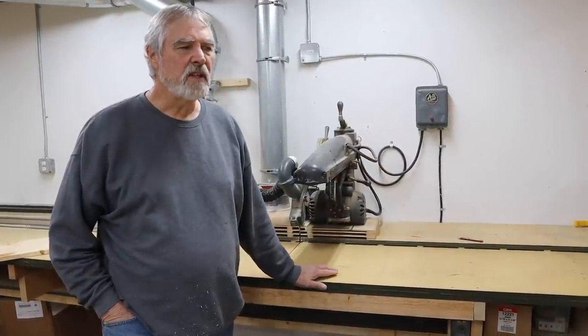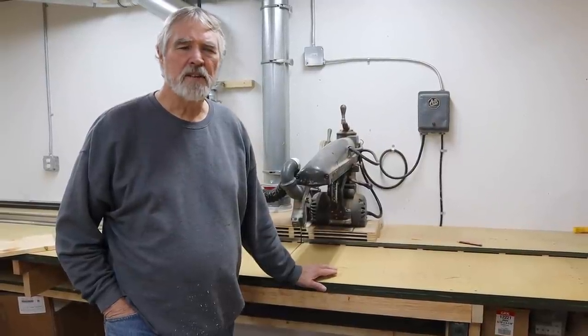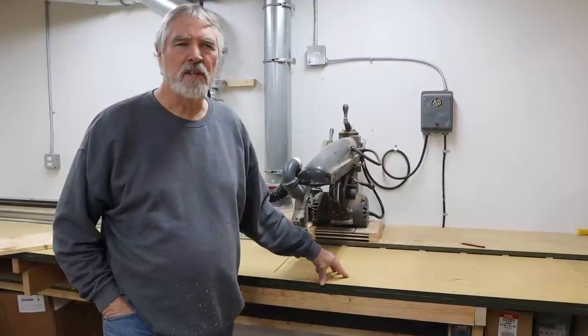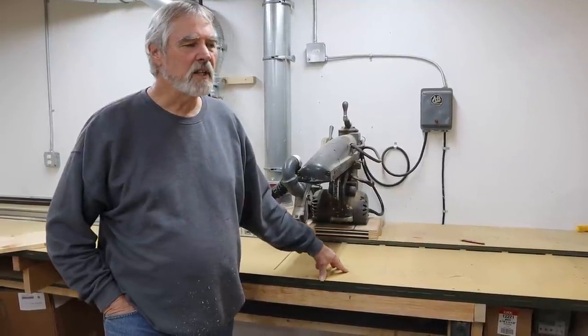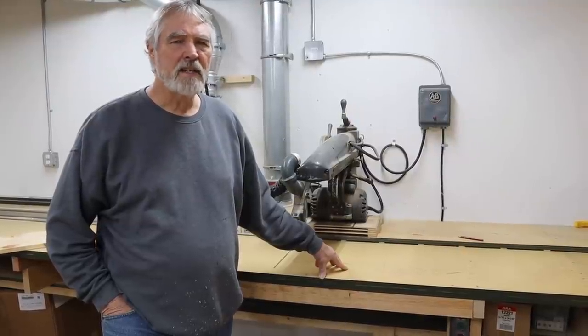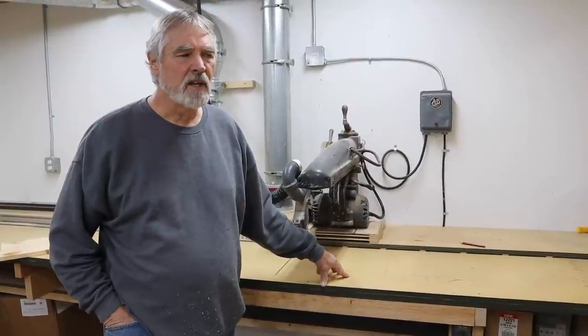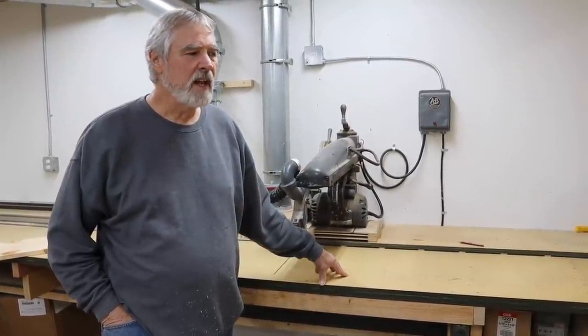I like to use the roughest lumber for the bottom board and the very best for the ends, where that piece is going to get most of the dado cuts for putting the box together. And then the sides have to be fairly good too. I don't like to have knots on any of the cuts, especially not in any of the dado cuts, and especially not in any of the handles.